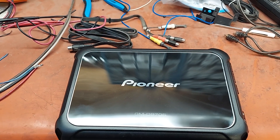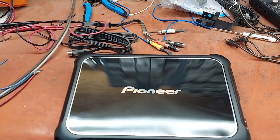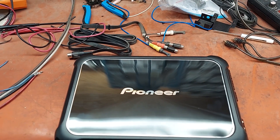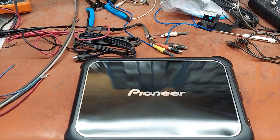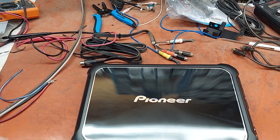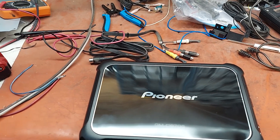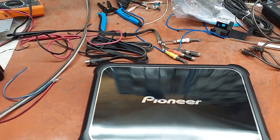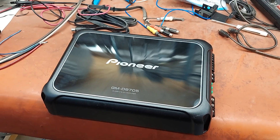There were typically two bass versions I've seen fail in the last couple years. One was fused with two 120-amp fuses, and another fused at 80 amps — both had problems. They just weren't going through the wave solder machine correctly and were getting fractures, causing units to stop working. It's a lame issue, especially because it's so expensive to process returns and refunds.